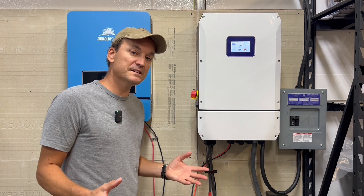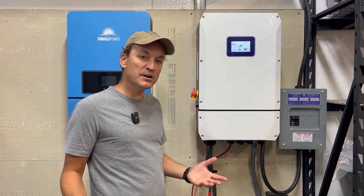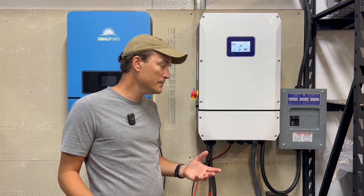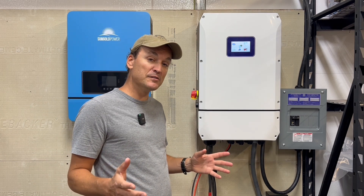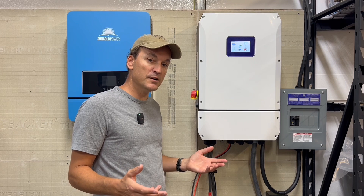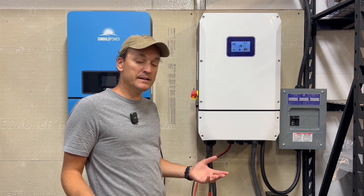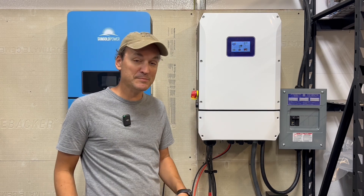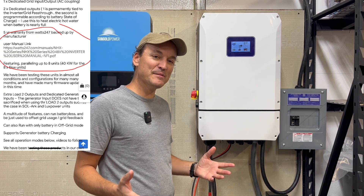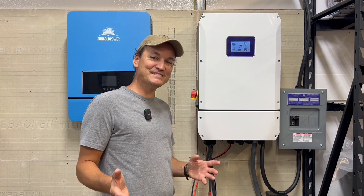There is quite a bit of price difference between this unit and an 18k PV, and some of it is going to come down to preference — what brand or style of inverter you want. The NHX is quite a bit cheaper. The 18k PV has a 200 amp pass-through though, and this does not. A lot of people will run their main grid power straight through the 18k PV, all 200 amps. The 18k also comes with built-in breakers — input, output, and DC battery breaker. So it's a give and take, a balance. Is there room for both on the market? Absolutely. I'll leave a link in the description below — you can check out the manual online if you want to learn more. I'll also put a link to the MK batteries I mentioned. Thanks for watching and stay tuned.